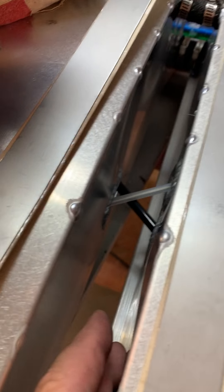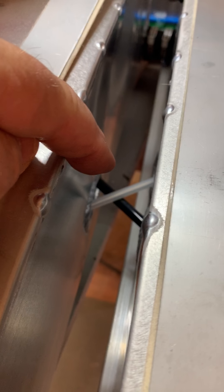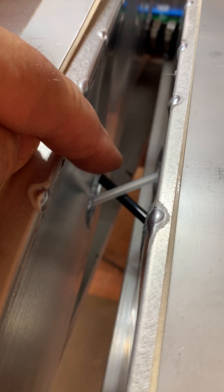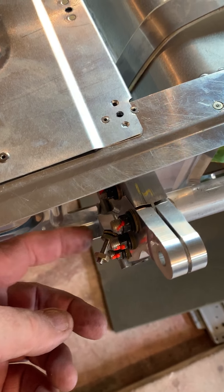As the manuals tell you, we're going to take some tubing — some white tubing is what goes for the small wire, and there's some black tubing where the big wire goes. Just be sure you're getting the small wire on top of the white plastic, on top of the black plastic, as we've done in the other bays. Remember the small wires go on top of the bigger diameter wires. Go ahead and slide them back through, get them into place, and don't tighten them up yet — I'll do that last.